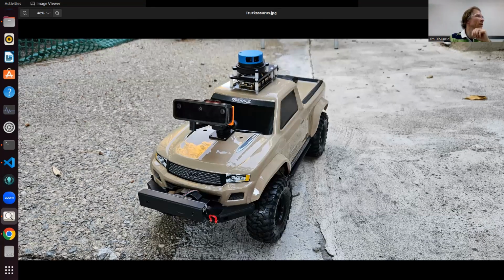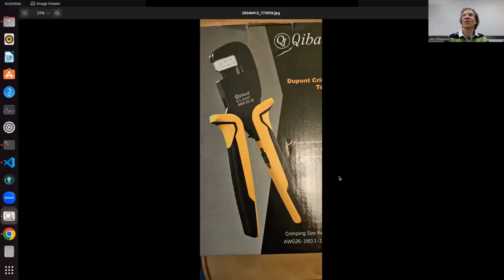It's very frustrating, because everyone's DuPont is a little different, every crimp is a little different. You'll get different success depending on which exact connector you use. So I bought this kit. I should have given a better picture, but this kit comes with the crimper plus a box of all the things you need, and it has instructions saying you need to use this last part of the crimper there. It shows you how to insert it a little bit inside, not from the outside. It's just a tiny little pamphlet that tells you, and then you just have to practice.